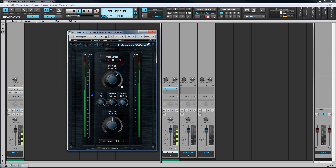There's a blue arrow indicator to the right of the pre-gain level display that shows the point at which any compression will start to be applied. The peak signal attenuation is displayed above the pre-gain control, and peak overall level increase is displayed beneath the post-gain control.